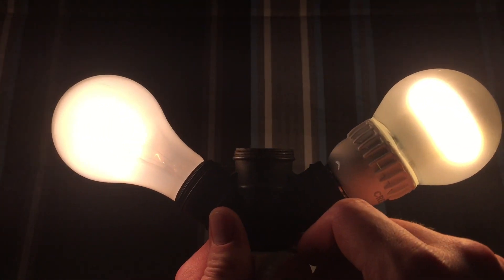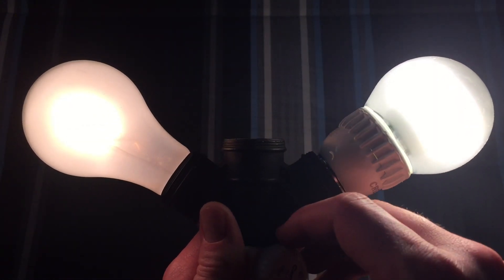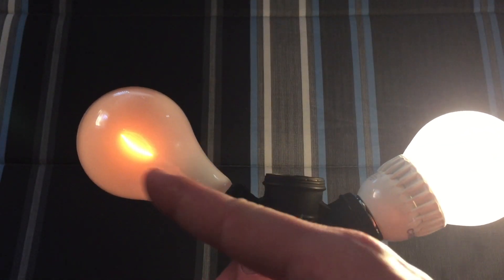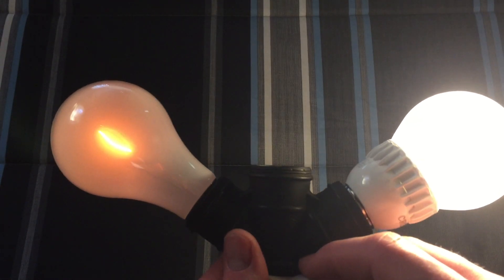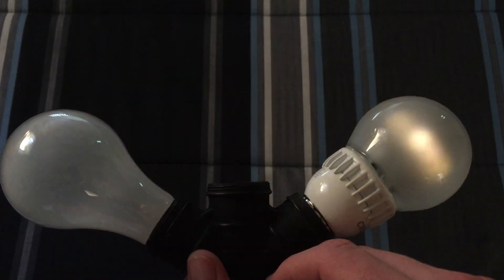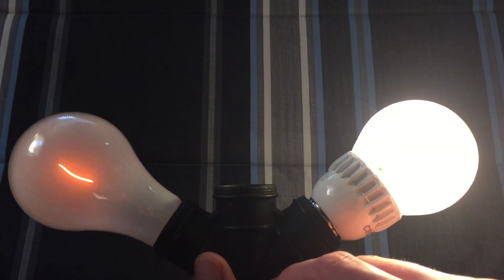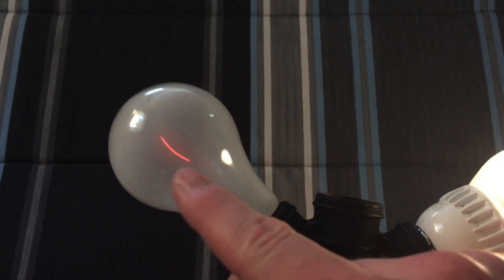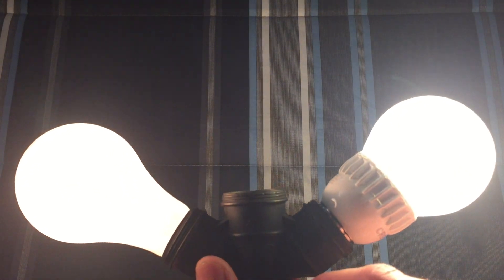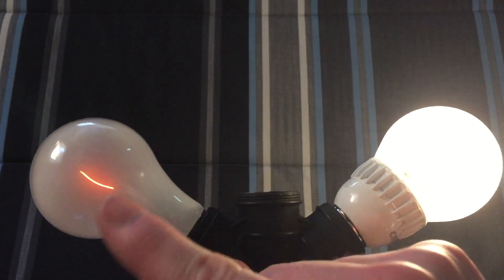So let's go ahead and dim it to see how well it dims with an incandescent. We're slowly dimming it down and just like an incandescent, it'll dim down a lot quicker and get a lot dimmer than the LED. So if you're trying to get an incandescent this dim and you're trying to find an LED that matches that, you're going to have a really hard time. The incandescent is almost out and we still have the LED on — oh, they both go out at the same time, so that's pretty good. But it definitely does not get that dim as you can tell. It tries to equal the same brightness as you would with a normal dimmer of an incandescent, but it definitely does not get that dim.